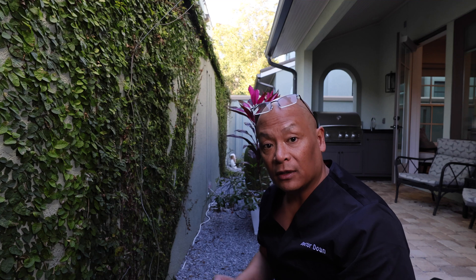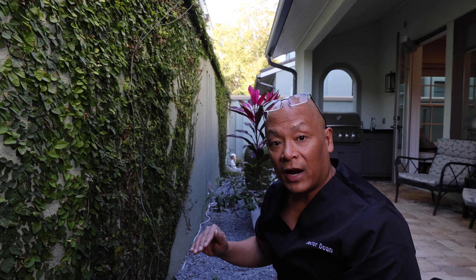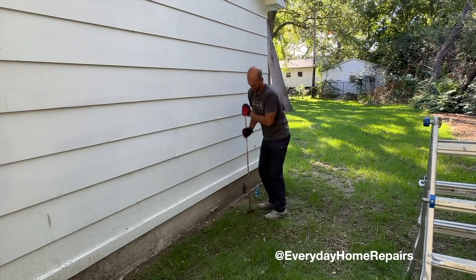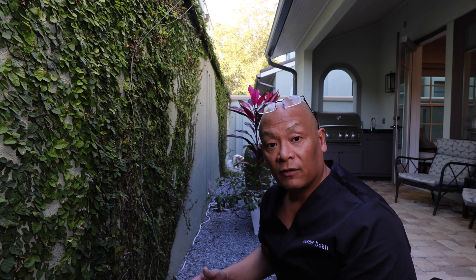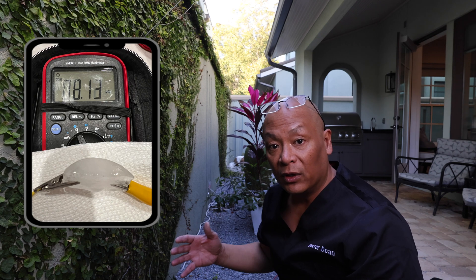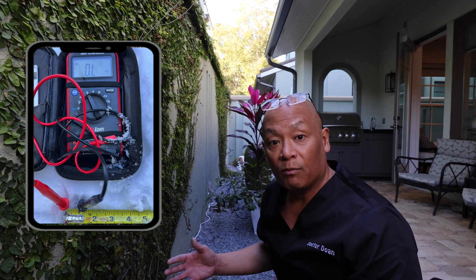If you live in cold climates, you should watch a video where I discuss the freeze line. Your grounding rod has to be below the freeze line. I live in Florida so the ground never freezes and I can use a 12-inch grounding rod without a problem. But if you live in a place with extremely cold winters, you may need an eight-foot grounding rod to get below the freeze line. It's really important not to have frozen ground with your grounding rod because frozen ground — like ice and snow — is not very conductive. As shown in images, the ohms are in the several million range with ice, and with snow it's so much that my meter could not even measure it.